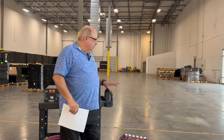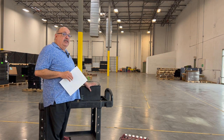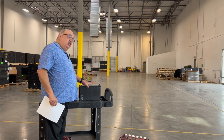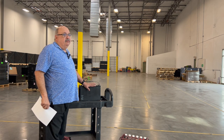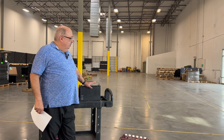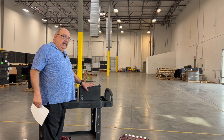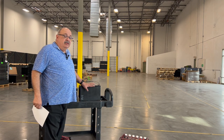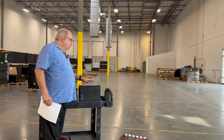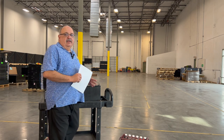With lead-acid batteries, they are simpler to configure. You can take two 12-volt AGM batteries, put them in series, and get 24 volts with a higher bank capacity. You can also put two banks together in parallel, so they're a lot more customizable than their lithium counterparts, where putting them in parallel is about the most you can do.